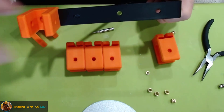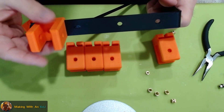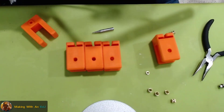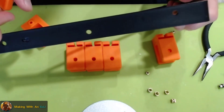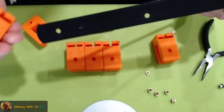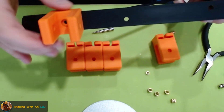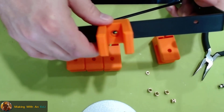You can also mount them the other way, but if you notice, the bottom and center holes are off-center while the one on the front is in the middle. So these don't work in that orientation because when you slide them on you only get part of the hole.